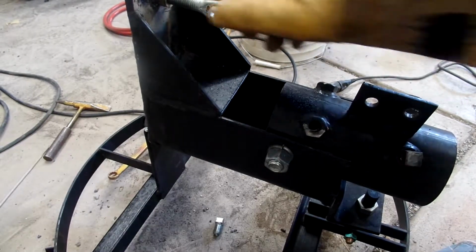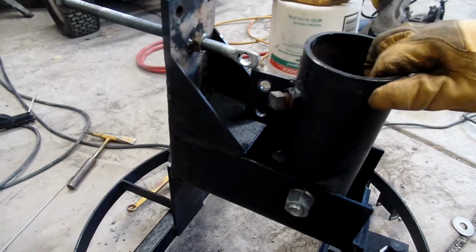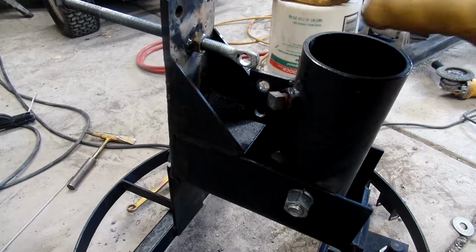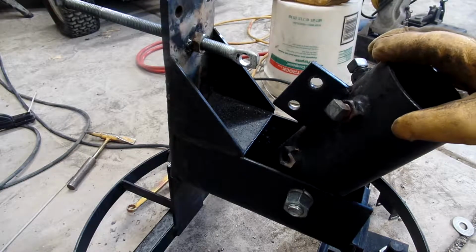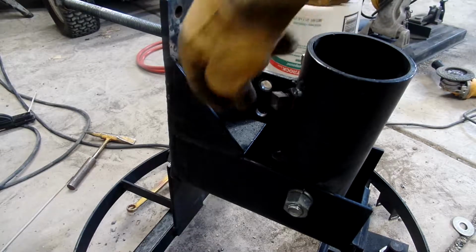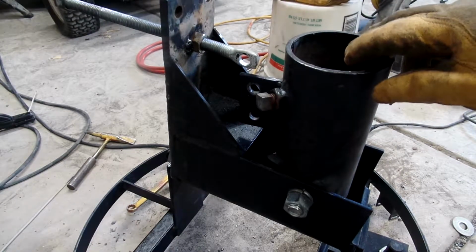Down in the shop here, looking for some sort of swivel to connect here to here, and I don't have it. I try to keep a lot of extra spare parts and stuff that could come in handy, but I don't have anything that'll work for that. I ran into another problem. At 90 degrees, the plate doesn't match up, because it's a satellite dish mount. I guess they don't want it sticking straight up in the air. The closest I'm going to get is here, which is about, I don't know, not quite 45. So I think I'm going to cut this plate off and flip it sideways so it's sticking up this way, and then I can hit either hole I need to, and that should give me adjustment to 90 as far as going all the way this way. I don't know, we'll have to see once we get there, but that's the plan for now.